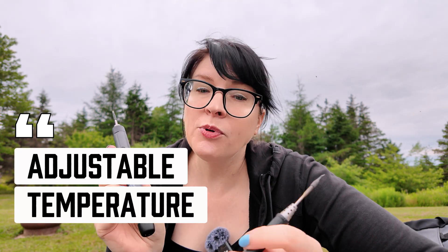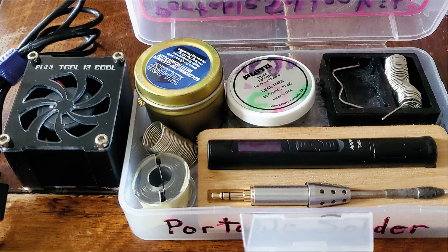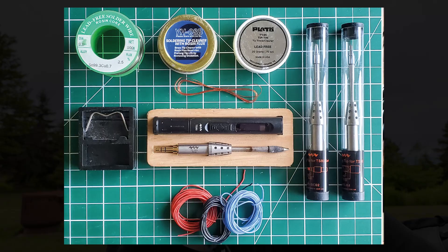Adjustable temperature is also important - both of these soldering irons have adjustable temperatures, so factor that into your decision. One last tip: when packing away your soldering iron, have a dedicated separate container. This budget one came with its own little pack, which is great. For the TS100 I have a little plastic container where I store my solder, tip tinner, brass tip cleaner, and so on. You might want to create a dedicated container to keep all your things together, including your wires.